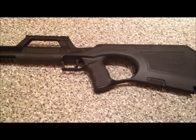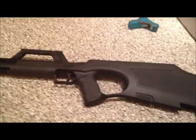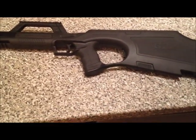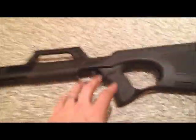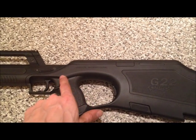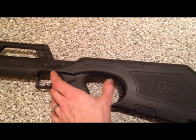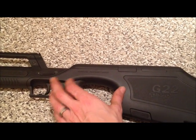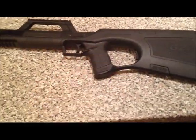It's a bit fiddly, but you know, the steel rod, I don't recall where I got it from. It could have been out of anything. I keep old bits and pieces of steel rods out of appliances, anything we throw away. It was a fairly thickish steel bar. But it just was a case of grinding it down, putting it in the vise, hammering and bending it to the right shape, to get it from the action. Just curved enough around here, and then onto the trigger itself. I extended it very slightly, just to push the fire mechanism back very slightly, and take up some of the slack, and obviously it's strengthened so it doesn't bend up here like it did before. But all in all, working well.